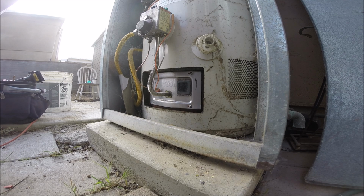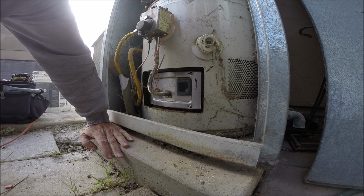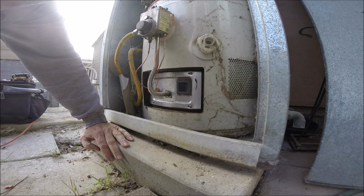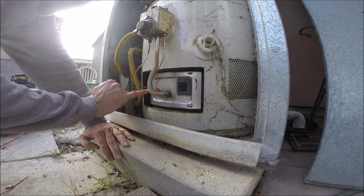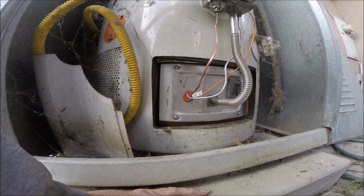that's it. Thank you for watching. Thermocouple replacement on what looks like a 2014 GE 50-gallon. Pretty simple. Just remove the burner assembly, free up the pilot assembly, pull out the thermocouple, insert the new one. That is a part that Home Depot sells. I think they're like $14, $15. And you got to try and run it through the stopper. That's probably the hardest part. These little stoppers just fall apart on you.